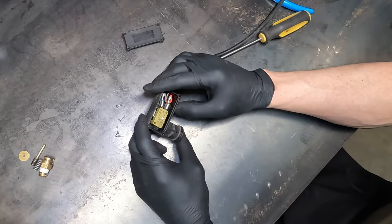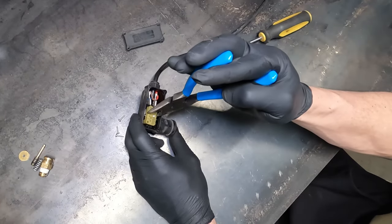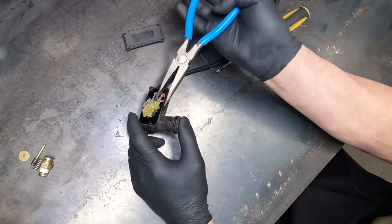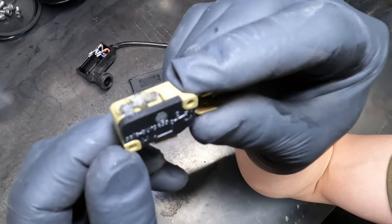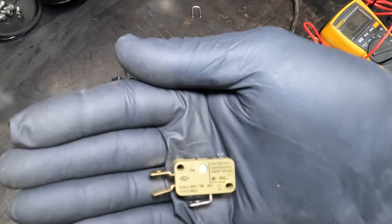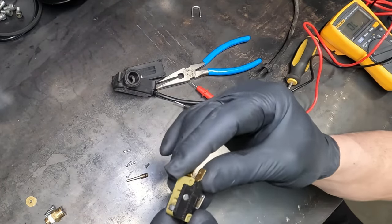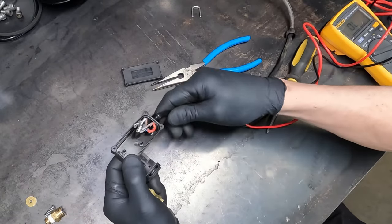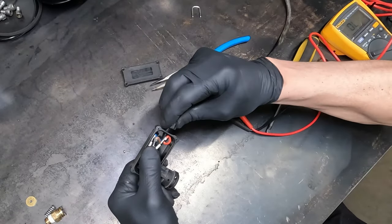There's our switch there. It's a pretty basic switch — it has normally open, normally closed function. It does look a little chewed up, a little bit of stuff chewed up on it. The model number is XGA2-88Z1. That would be a pretty common switch — you can probably find it on Amazon, because these things are about 60 bucks to buy. It's a $5,000 pressure washer, so it's a pretty minor part. But still, it's money you don't really need to spend if it's only the switch.